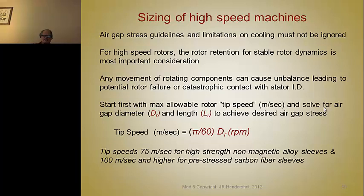In the case of induction machines, they're a little trickier at high speed because the mass of the bars can cause them to move and change the balance. With high enough centrifugal forces, you can actually force the slot openings open and the bars could even touch the ID of the stator — since the air gaps are small — which would be a colossal disaster. So something has to be done to hold the bars in the slots.